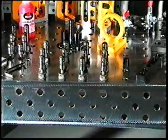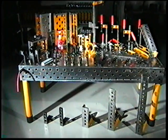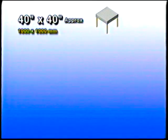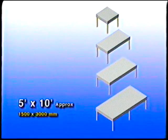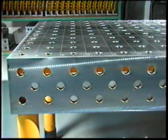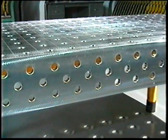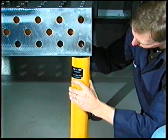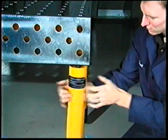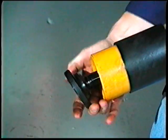A closer look at this 3D clamping system reveals how these benefits are made possible. The key to the system is making setup as easy as possible. The heart of the Demmler D28 system is the 3D welding table. The table is available in four sizes: 40 by 40 inches, 40 by 80 inches, 4 feet by 8 feet, and 5 feet by 10 feet. The tables are made of high quality, high tensile strength steel, welded and ribbed. Legs are easily attached with a tapered locking screw. Uneven floors and height differences are compensated for with adjustable legs, giving even greater stability.